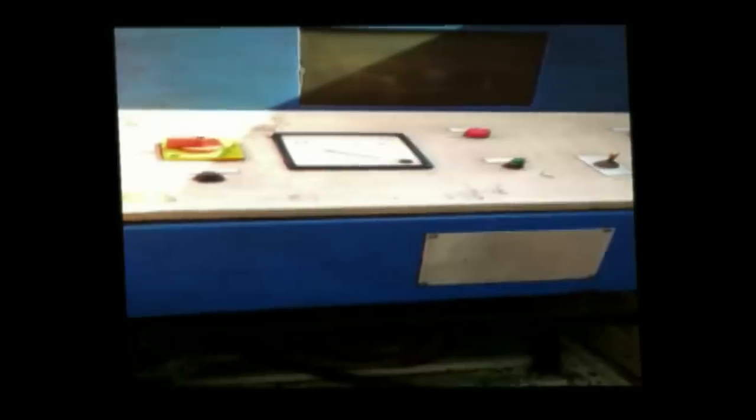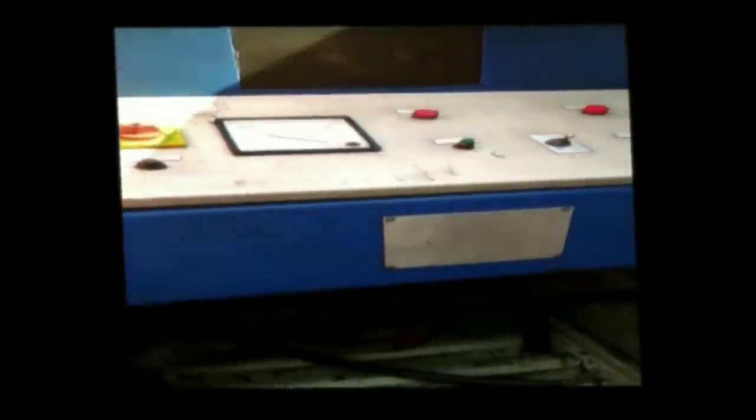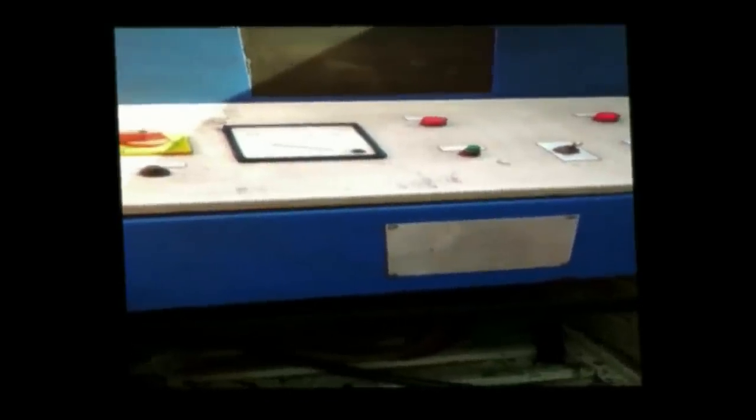Step by step we are increasing the voltage applied to the transformer oil. Now you can see the flashing carried out inside the transformer oil — this shows the BDV value. The flashing is carried out at 45 kV. So before oil filtration, the transformer oil can sustain up to 45 kV BDV voltage.